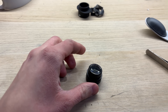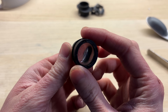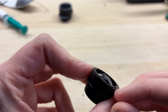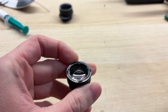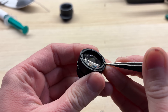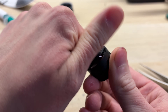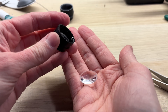Inside the plastic housing is the magnifier assembly. As you can probably tell, this one is quite big as well, so let's open it and see if we can get it even smaller. Thankfully, the inside part of this assembly has some plastic threads that make it look like it should be fairly simple to open it up. I should be able to open the module by rotating this part right here. The plastic part basically acts like a simple screw, maybe even like a bottle cap. With that part removed, I can now easily take out the lenses.